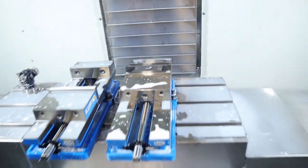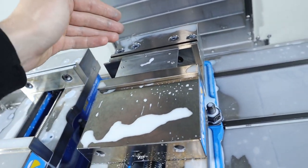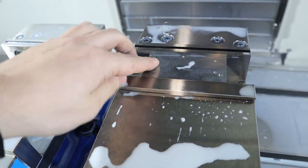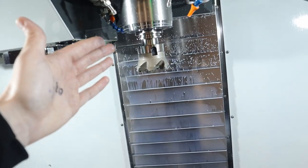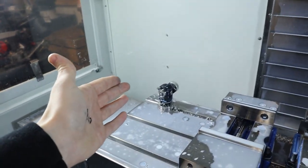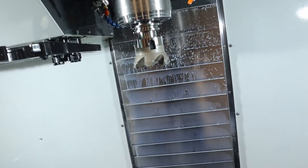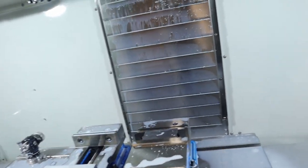Oh yeah, I forgot about the carbide piece I left in there. I'm sure that thing's effed. Okay, that went sort of good. I mean, sort of, not really. The plate is 4 thou too short, so it didn't even cut the pocket for the washers. And then I re-measured the shell mill off the tool setter, and it was off by 4 thou. So I don't know, what gives? We're gonna cut another piece and try again.